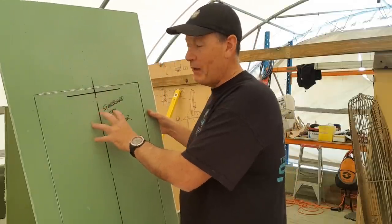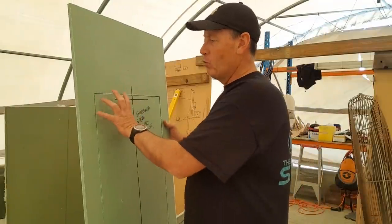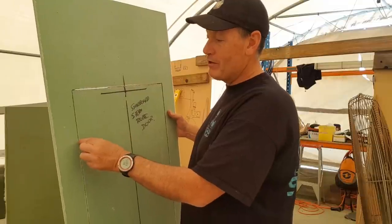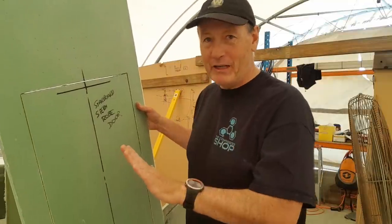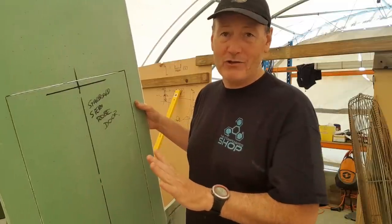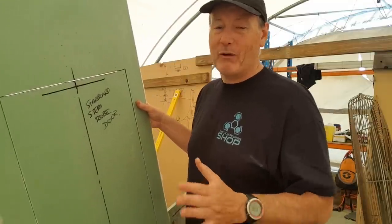But what I'm going to do is these foam panels are likely to have a wooden veneer on them. But I'm not going to just stick wood onto the entire foam piece. This door here is likely to have a solid timber frame around it, and then the foam inserted into that, and then the veneer vacuumed onto the outside of that. I'm planning to vac the veneers on. If there's a better way, I'll do that, but I have a vac system, so I might as well use it with a vacuum bag.